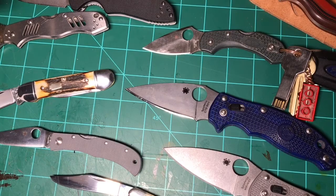Rockwell hardness is not the only determining factor when it comes to edge retention. Just because you see a higher number on one of these knives, a higher number doesn't necessarily mean a better steel, and it certainly doesn't always mean better edge retention. There are other things involved, like carbides — some of these steels have a lot of vanadium, which forms vanadium carbides that help with wear resistance even at lower hardnesses. Hardness is probably 60–70% of the equation, but it's not 100%.